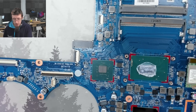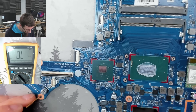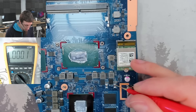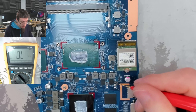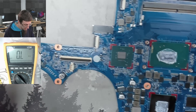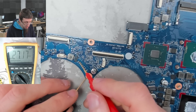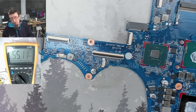Once again I'm going to do some short checking just to make sure we're all good and none of the new capacitors are faulty. We check the caps themselves — we should find ground on one side: there's ground. And the other side should be high resistance: kilohms and rising. The resistance is rising because the multimeter is charging up those capacitors — it's passing a small amount of voltage through the probes which charges the caps, and as they charge their resistance increases. Slowly increasing resistance like that is probably capacitors charging up. Let's go over and check our battery charger — this was also shorted earlier. It now has 17 megaohms on it and drooping as things settle. Lots of resistance — it's all good.